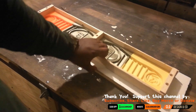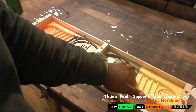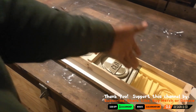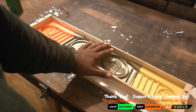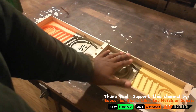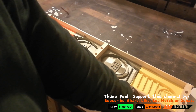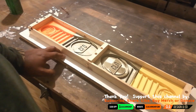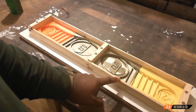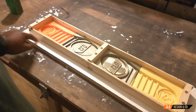So now we got the mold screwed down. One thing I want to mention — if you look in between these two halves, that's where the weakness or the runs of the mold can come from when I pour in a liquid, and it could spill out. So anytime you make a mold — I don't care if you're working with plaster, concrete, plastic, whatever you're making — you want to make sure it's sealed. So I might run a bead of hot glue around the outside and maybe in between the seam to make sure that there's no leaks. Be sure when you're making a mold and getting ready to pour that you are sealing all the seams.